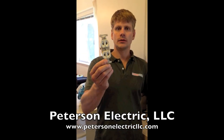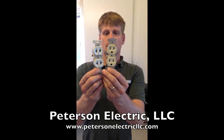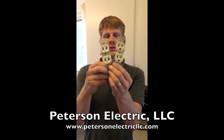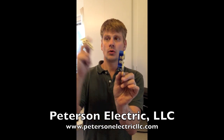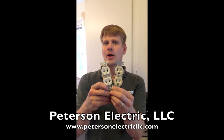How you know is you've got a two-prong outlet like this versus your three-prong like this. Right here is your grounding on your three-prong, but that doesn't do you any good because if you don't have a ground wire on this terminal going through the branch circuit to the panel and then to a ground rod, it's not going to ground.